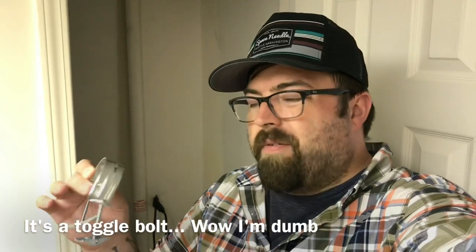I'm going to attach this bracket a little higher up to keep the pipe from moving around. I've got these — I think they're called butterfly mollys, I'm not really sure. I figured this would give me a more secure hold to the backside of the drywall than a regular molly. I'll be drilling a 3/8 inch hole. To attach these, you have to take off the bottom triangular part, put the nut through, and then put it back on. I've got my homemade washers on there doing their job.